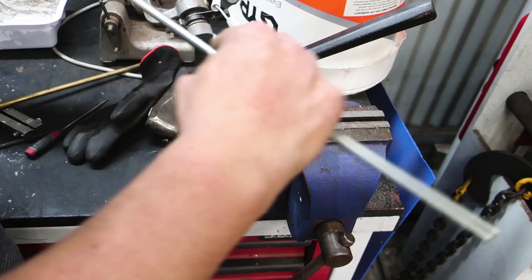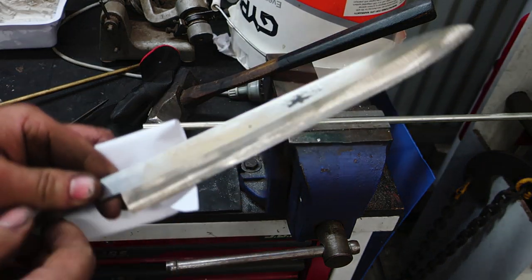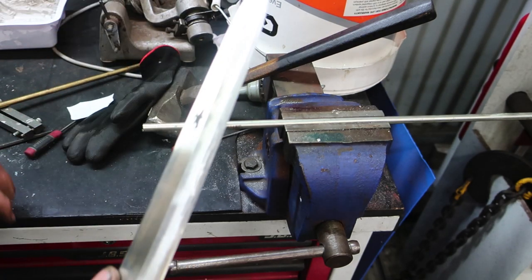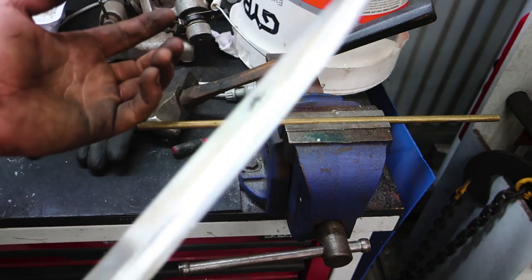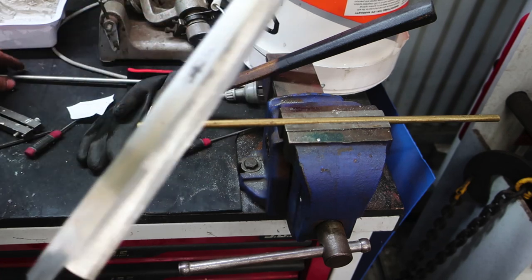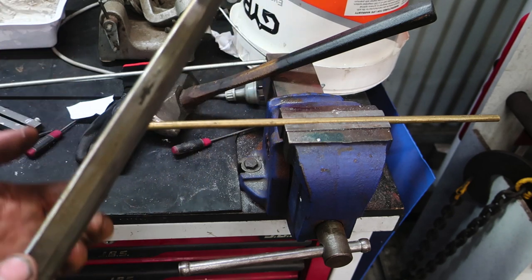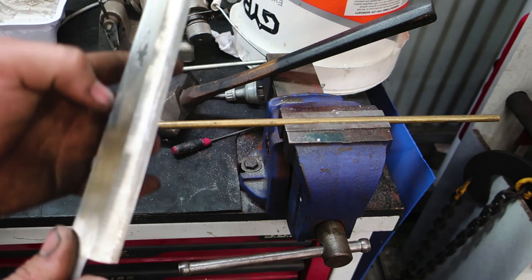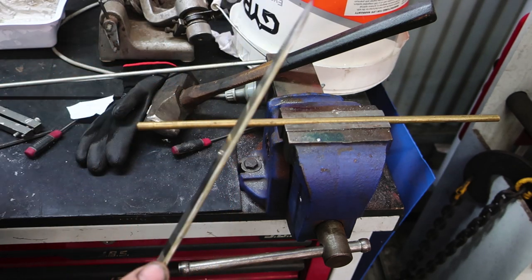Okay, last time I didn't show you guys testing the knife, so I'm going to do that now. For this knife here, it's sharp, kind of sharp. It's off the belt, so I mean, it cuts. I left maybe less than 0.5 of a mil on the edge, and then I radiused it off. The reason why I did that is because I want to minimize the damage, if it takes any, on the actual copper test, the stainless steel test. If I had added a finished grind, it would probably take big chunks out of it, and then I'd have to bring it back and shorten this. If I have it fairly thick on the edge, the amount of damage would not be that much. But the aim is to weld on this, do whatever, and then see if it will still cut paper.